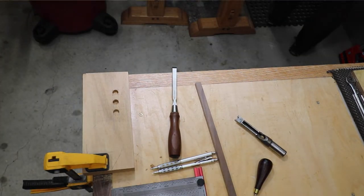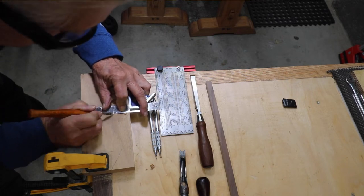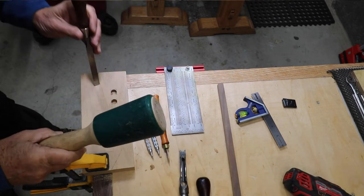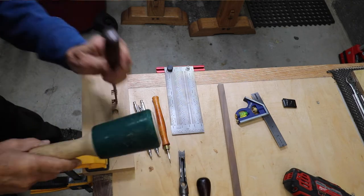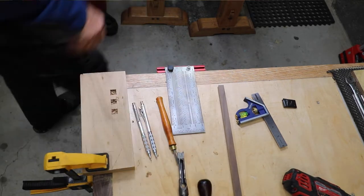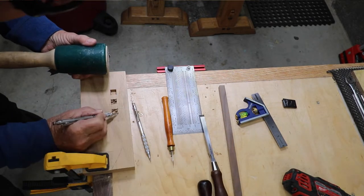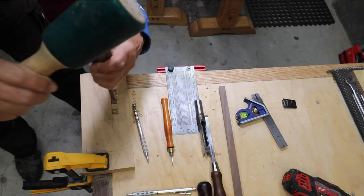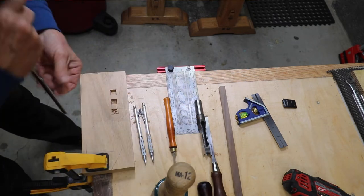You can try to use a mortising chisel, but I find those are very hard to line up with these holes and you've got to be very careful. My preferred method is to use a combination square where I can see the exact edges of the holes, and then use a scribing knife to give myself a nice line to chisel to. When you chisel, don't go to the edge at the very beginning — start on the inside and work your way out to the very edge. If you're just slightly off, do not use the mortising chisel; go back and line up using your regular chisel. Because if you are just a touch off, it will show up when the plugs are side by side — there's no such thing as 'that's close enough.'